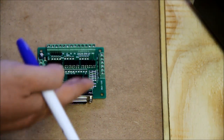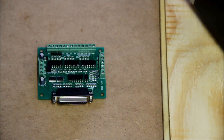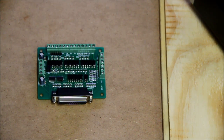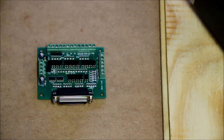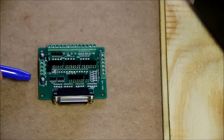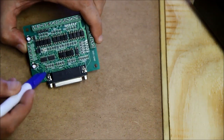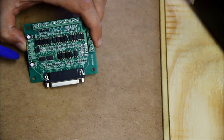The parallel port from the computer plugs in here, and the software then talks to this via the parallel port. Mach 3 or whichever software you use will talk to the board by the parallel port — that's the crux of the whole matter. Over here we put power — this is normally five volts depending on what board you have. Generally it's five volts; you can see it says ground and plus five volts.